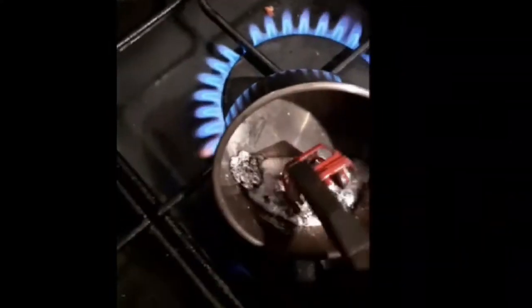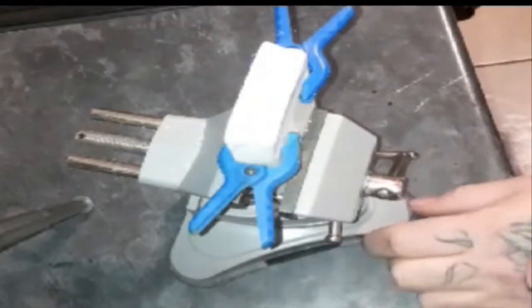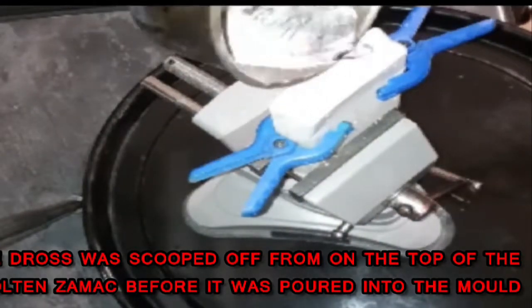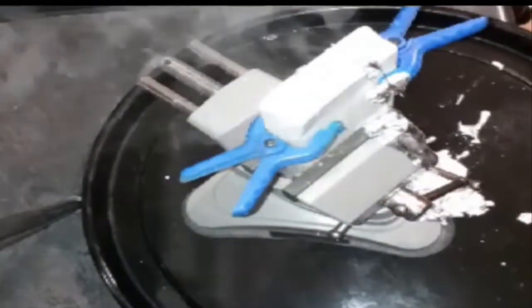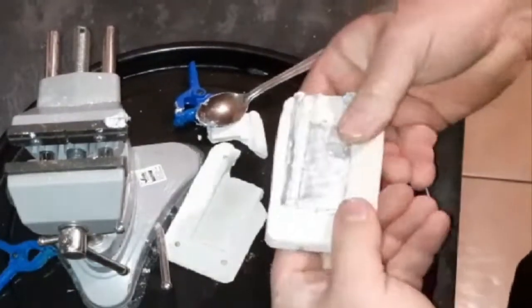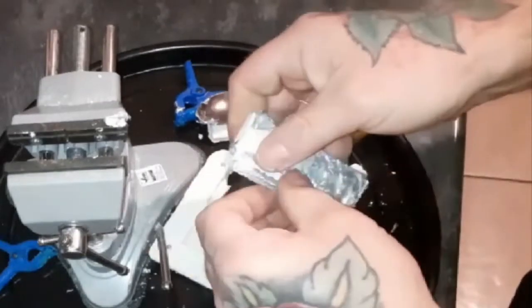Just pre-warming it and melting the wax in. I'm using old Zamak car bodies for this — Zamak is what old die-casts are made from. It stands for zinc, aluminium, magnesium, and copper. It's easily melted on a normal stove; the melting point is between 400 and 430 degrees C, and as you'll see it pours quite nicely. I ran it under cold water to cool it down, then broke away the mold to clean the cast up.